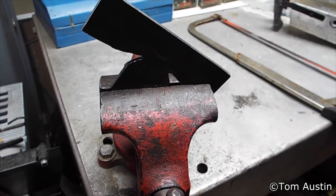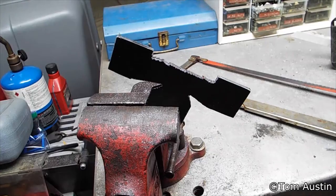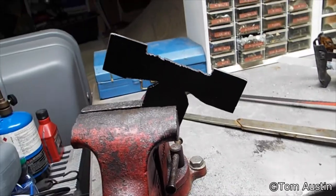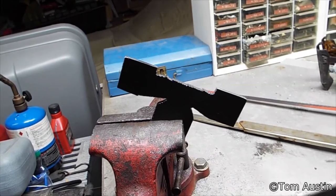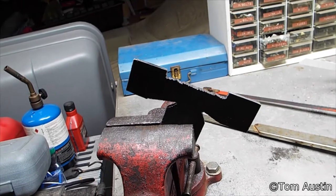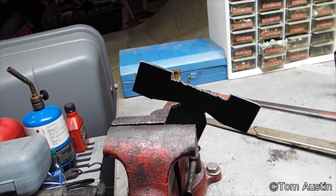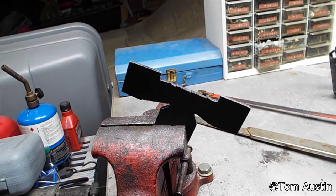You could also just drill some pilot holes and work with that. That was the last of the cutting. Now I just have to sand down this piece, fold the wings, drill the holes, do the final filing, sanding and fitting, and it'll be done.